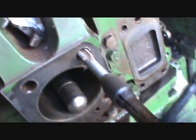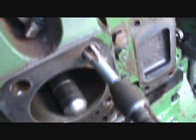It's a nice day today, nice and sunny. Back at this 4320, I've got the hydraulic body mounted back on there. You can see just a little bit of a form of gasket on there — you can peel that right off if you want, but it don't matter, it's sealed all the way around. What I'm doing here is chasing out these holes because there's a little bit of rust in them, so I've got my 5/8-11 coarse thread tap there.